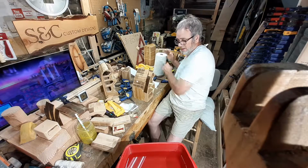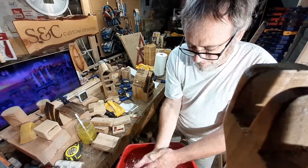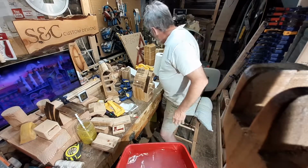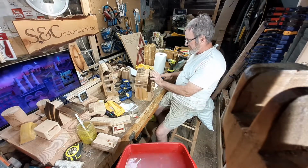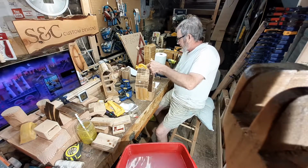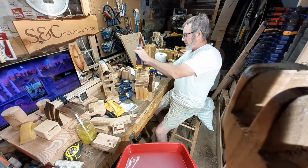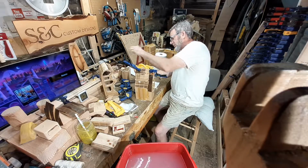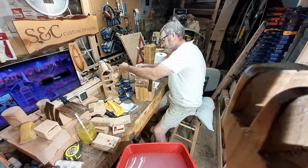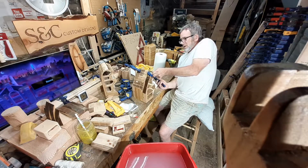Okay. Well, more than likely, the most critical point of the glue up is going to be the top part there. Now, the way I did the other box was, and don't squeeze too hard when you're pulling the clamps down, okay? That's what you don't want to do. You don't want to squeeze all your glue out that you just put in there. Take the opportunity when you're squeezing it together to make sure that it's aligned properly, okay?